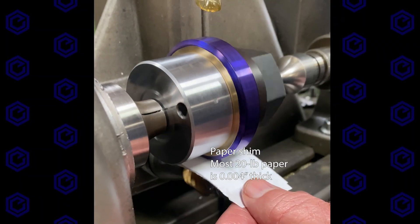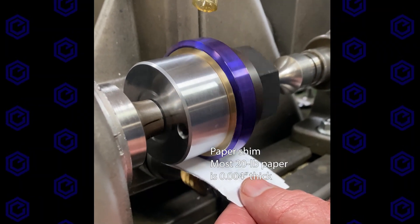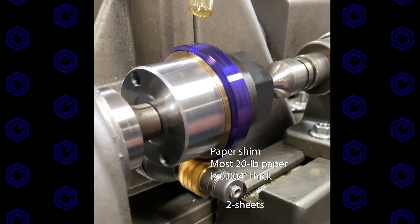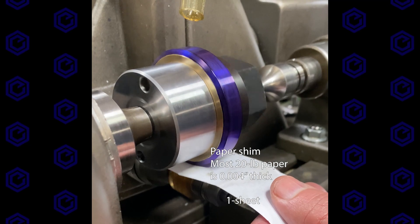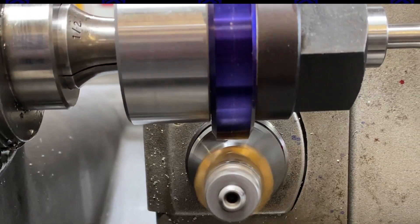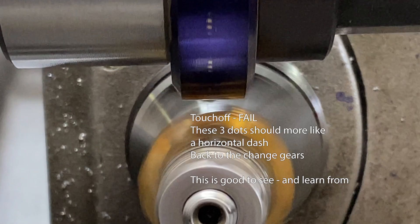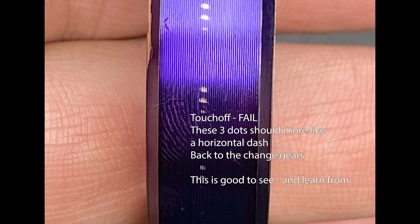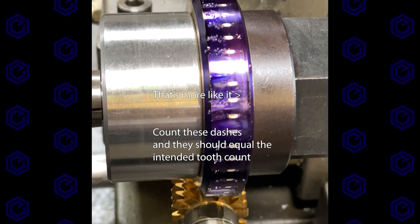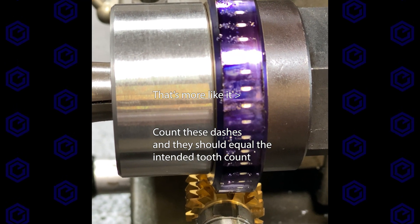Here's the process for touching off: a piece of paper is about four thousandths, so we got two sheets here for eight thousandths. We just touched off and pushed the paper out of the way, came down with our depth of cut — and sure enough we got two issues. One, the hob's not axially aligned, and two, we totally failed on the touch-off. That's supposed to be one line, not a series of three. That means something's wrong with your change gears or your machine.